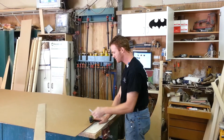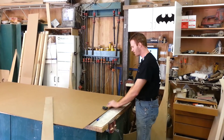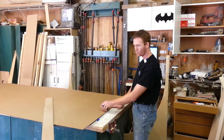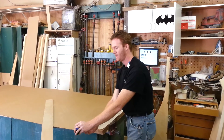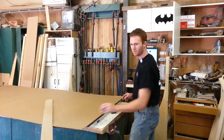First I'm going to lay out the width of my door, which will be 32 inches. I'll divide that in half, which is at 16, and then I'll go beyond my door for the pivot point for the arch, which will be the same distance as the midpoint. So I'll add 16 to it and come up with 48 inches, and that will give me my pivot point.